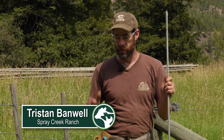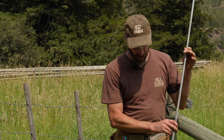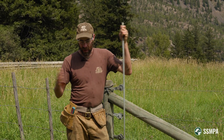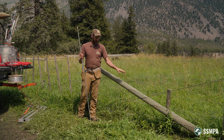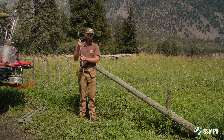Let's talk about one of the most important components on your electric fencing system and the single most common cause of poorly functioning fences and other fence problems — and that's your grounding system, also called earthing system in some parts of the world. The hot wires on your fence are only half of the equation. When an animal touches a hot wire on the fence, the current has to complete the circuit and flow back to the energizer, and it does that through the ground circuit.